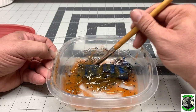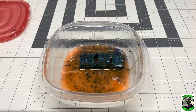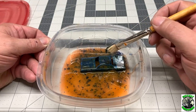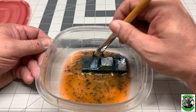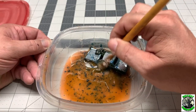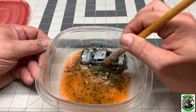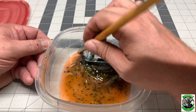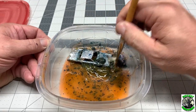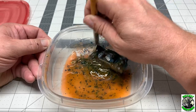I coat the whole thing and usually in about five or ten minutes it'll work, but I let it set a little bit longer — about a half an hour. Look how easy that paint comes off. Now there are many different kinds of paint stripper out there. I use this Citrus Strip, but I also use the aircraft stripper, which unfortunately is becoming a little bit harder to find because of a problem with one of the chemicals inside the mixture. But the stuff works really well. And any of you kids under 18 doing this, make sure you've got your parents' permission and supervision before you do anything with any kind of chemicals.